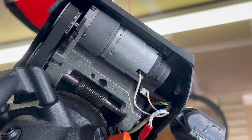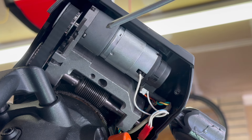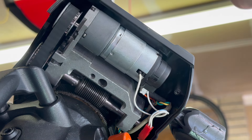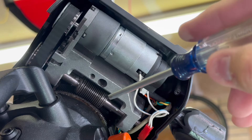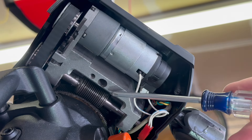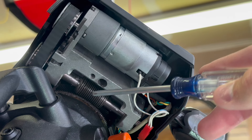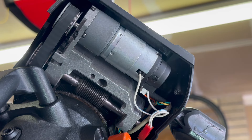I'm going to be using the declination axis as our example for today. We need to understand how everything works in the CGX to be able to do the maintenance properly. You've got your main servo motor right here. There are some reduction gears in here, and it goes out to these two pulleys, which of course have your belt on it. This is what spins around — if I hit the hand controller, you can see it spins around. You've got the bracket that it mounts onto, and these two screws here which adjust the tension between the worm and the main spur gear. The worm gear is back here and it meshes with the spur gear on the bottom of the declination axis.